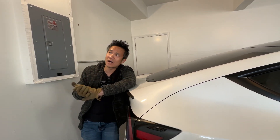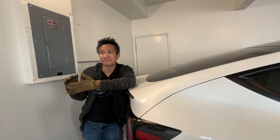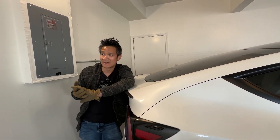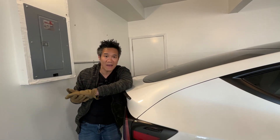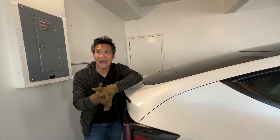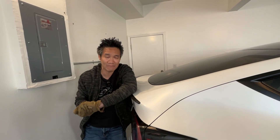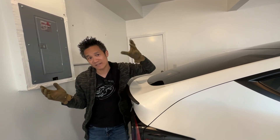We don't have a big roof — it can handle maybe about seven or eight kilowatt total in solar panel capacity. So we still need to use grid power to charge our batteries, because we plan to have about 30 kilowatt of battery power since we use about 30 kilowatt per day. So that's our situation.